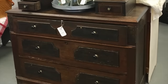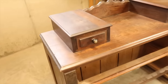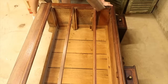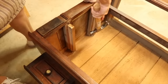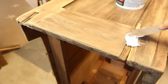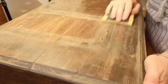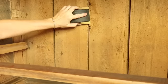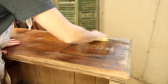This is a great dresser, right? But what good is a dresser if you have no use for it? I used two of the drawers for another project and then decided to make something useful with the rest of the dresser. I removed the top drawer runner by cutting it with a hand saw, then knocked the side pieces out with a hammer. The dresser was old and had some missing wood, which I filled with wood putty. I sanded the entire piece with fine grit sandpaper and wiped everything down with a damp cloth to remove the dust.